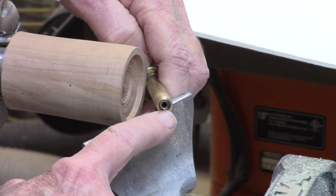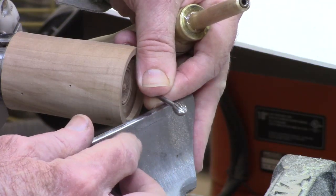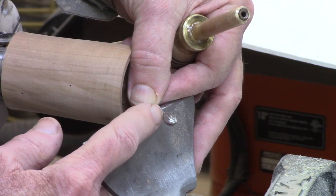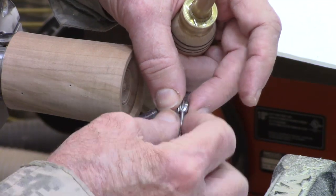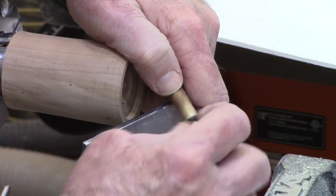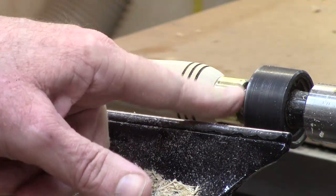I have affiliate links for all these parts — the three bearings were less than three dollars off Amazon. These Dremel burrs come in three different types, which I'll detail in a future video. They're available at your local home improvement or hobby store, or on Amazon. They're 5/16-inch across, high-speed steel, with a 1/8-inch shaft. They rotate freely because I have a small magnet at the bottom that holds the burr in place so it won't easily come out but will spin freely against the magnet. I turn a small handle about six inches long, use a brass compression fitting for the ferrule, and will drill it before parting it off.